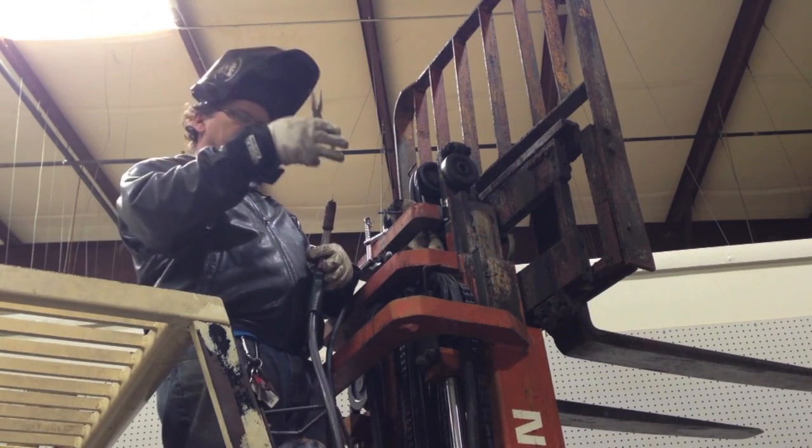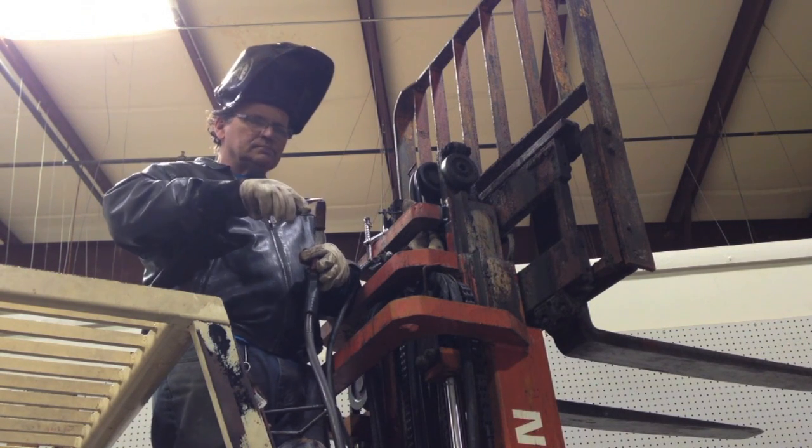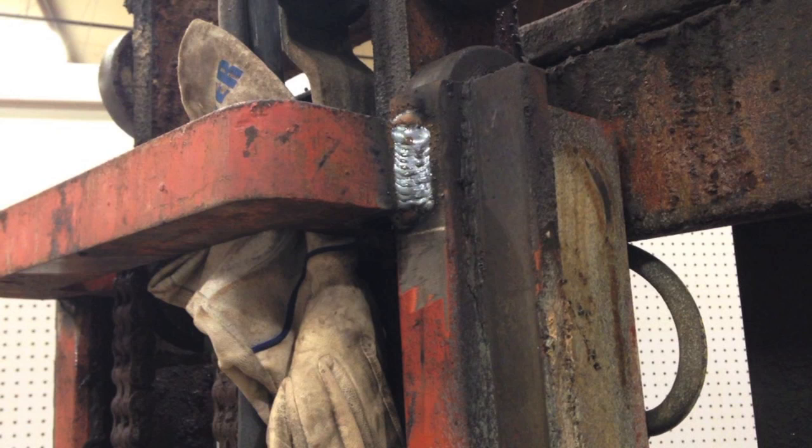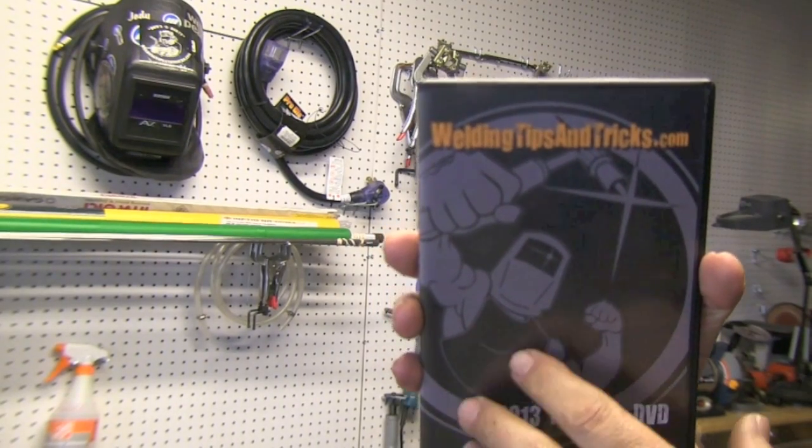That's why I'm taking a little bit of care and beveling and putting 2 passes and even testing some weld joints beforehand. And so that's almost done. I've still got to wrap those corners and make it look a little bit better, but the job is done.